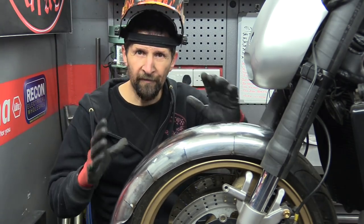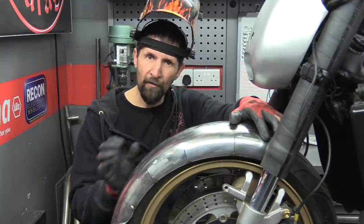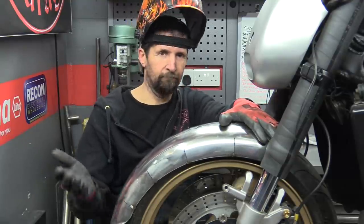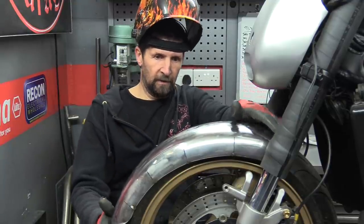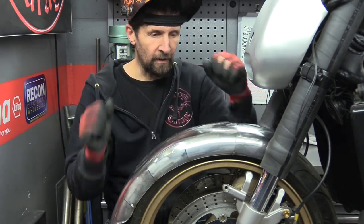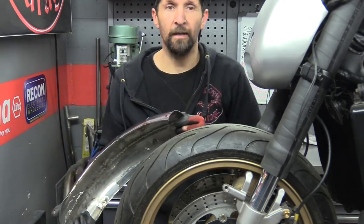It's still not quite perfect but it's good enough for what I've got in mind. It's gone from about half an inch run out at the end to about 5mm - so a 7 to 8mm difference - that's pretty cool. And once I weld all those slits up, that's going to pull in a little bit more yet. So let's tack the other one so we can make them the same.